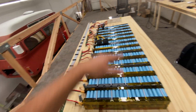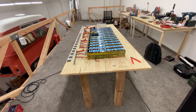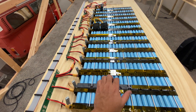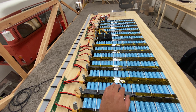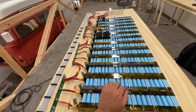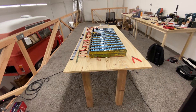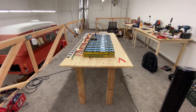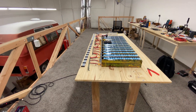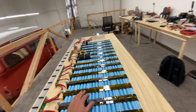I will be able to check individual cell voltages. I'll run it daily here, doing tests. We'll test it for a few months and see how this goes. These are so far demonstrated to be very, very high quality cells. The only way to put that to the test and provide some data is by testing it — doing a project like this, running it like a 12 kilowatt hour Powerwall, load testing it, and cycle testing it to see how well it does after 100 cycles or so. 100 cycles would be just over three months.